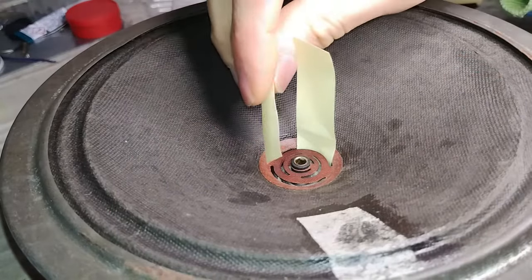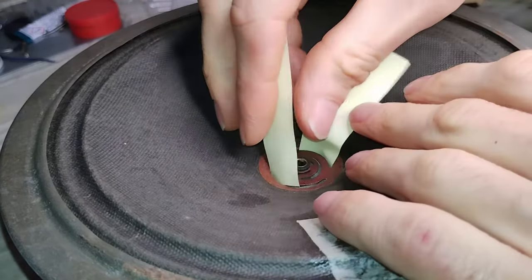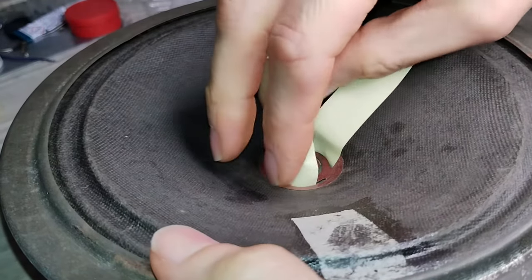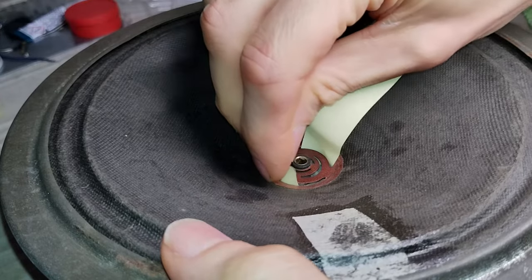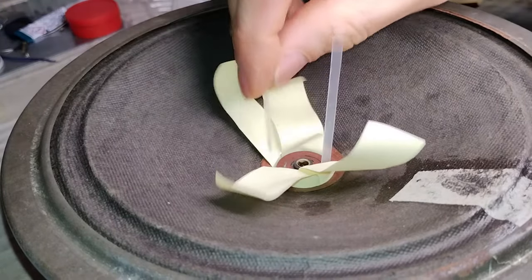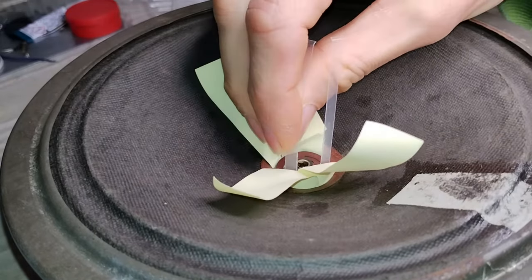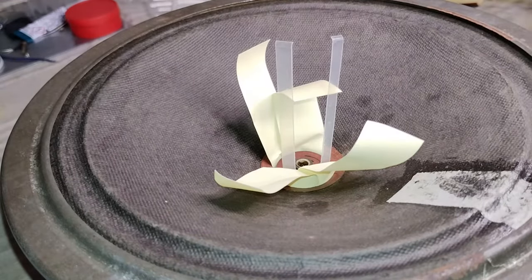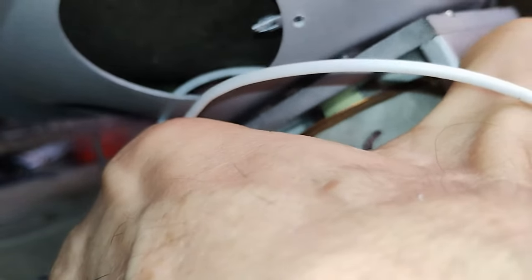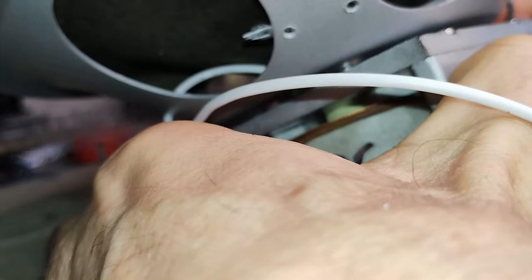While the basket still feels slightly loose, some paper is inserted between the speaker coil and the pole piece to align them. Also, some thin pieces of plastic might be used, but very gently, because the body of the speaker coil is very fragile and it could break very easily. However, the clip does not show that at this stage it is necessary to put the screw back in the middle of the cone. The bolts are then tightened a little bit more with the wrench, but not too much yet, because the proper alignment of the speaker coil must be verified before the final tightening.